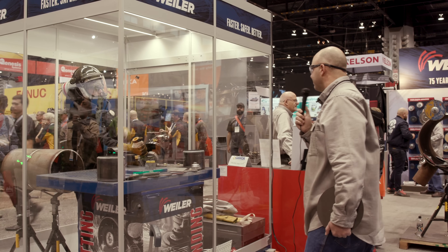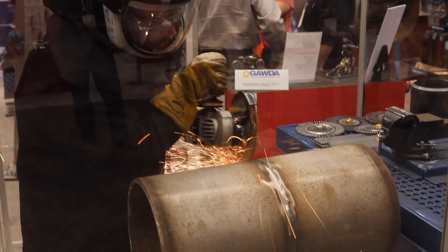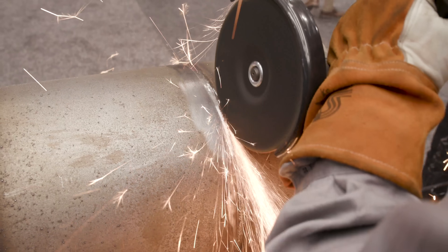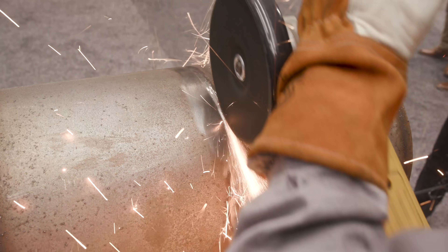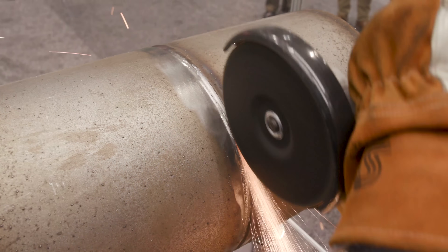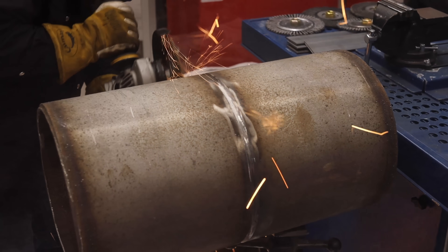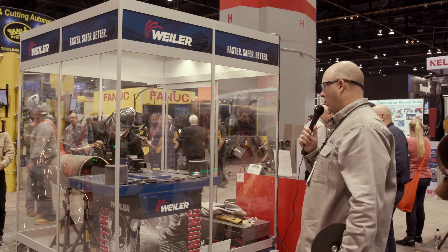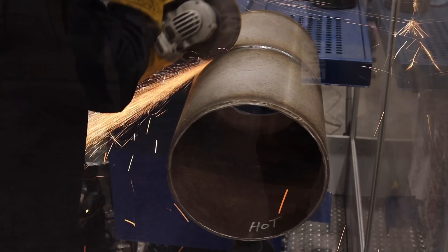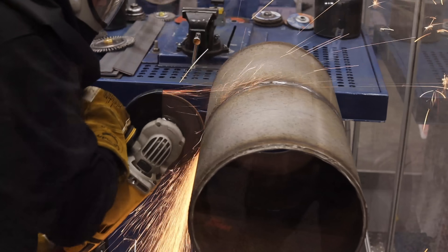So as he gets ready, he's going to take that wheel to vertical — this is what we mean by notching. As he does that, you're going to see how smooth that wheel is. A lot of times what you see — and what the Tiger Pipeliner eliminates — is that chatter. Chatter isn't only uncomfortable; if you would jump out of that weld and nick the body or scar the product, that could possibly be a cutout. You can see how smooth that is as he goes up and down, developing a little U in there.